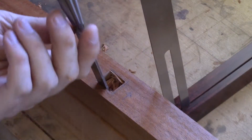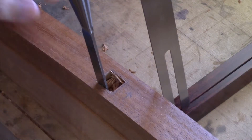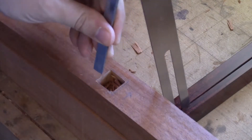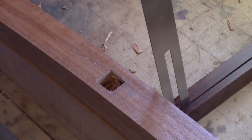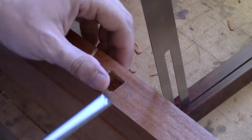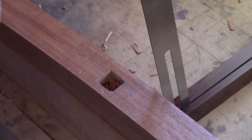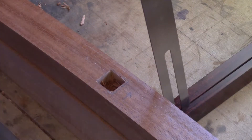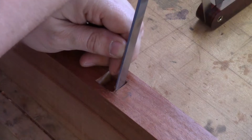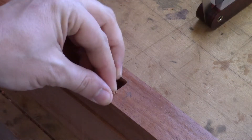Checking from the side — my angle looks really good. My angle may be just a little bit steeper inward than matching, and that's okay. This mortise and tenon joint doesn't actually support the arm — that's what the panel does. We're just trying to nest the arm inside the leg. I'm going to walk my chisel along the lines of the mortise wall back until they connect in that corner, creating a nice clean corner without taking away too much material.